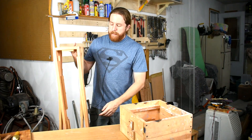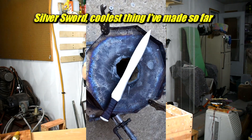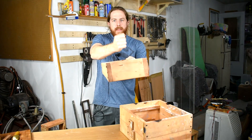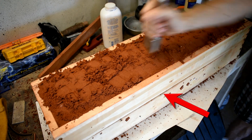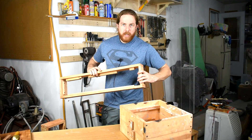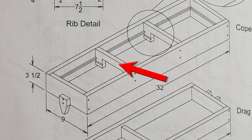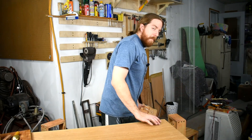The next issue is easiest to demonstrate on these long ones — the ones used for the swords. When you start ramming sand up in the middle, it actually bows the sides out a noticeable amount. There are a couple ways to get around that. If you own the Gingery book, he shows casting the lathe bed as bracing — that's a good idea. I'm going to do something else, and that's a good place to start making the new one.